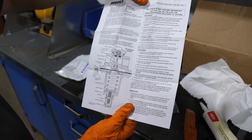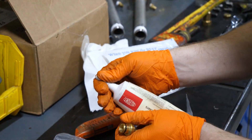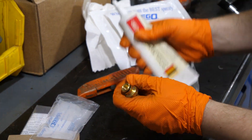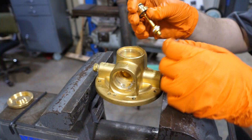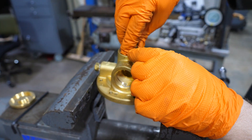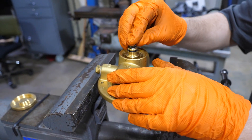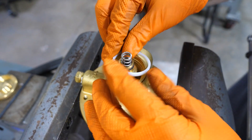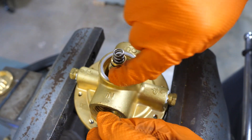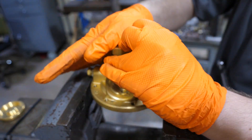Also note which parts will be used again and which ones will be replaced. Always use the new parts if supplied in the kit. Lubricate the O-ring of the new seat disc assembly with a lubricant suitable for the gas the regulator is used on. Install the new seat disc assembly with the new small spring. Nest the spring in the socket of the seat disc assembly. Place the new Teflon seal in the counter-bore of the body. Install the new back cap in the body using approximately 30 foot-pounds of torque.